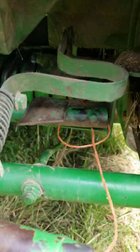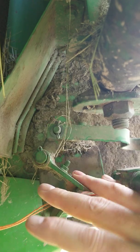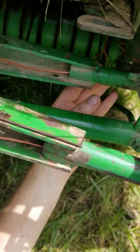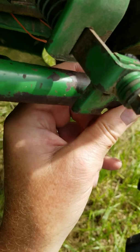There's a little thing here — your twine comes in this little box, this thing comes down when it gets tight. Here's your two arms, and these two arms come forward. It's double twine, one comes from one side, one comes to the other. There's an adjustment here so this hits when this comes forward, which spring-loads this thing and drops this little knife blade down.